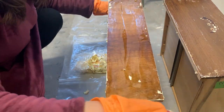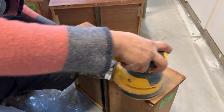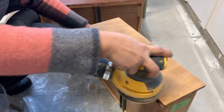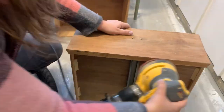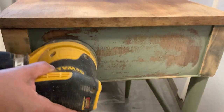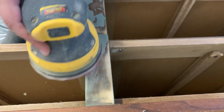After removing the previous finish, I washed these drawers with some mineral spirits, and this is how they look after. It was actually coming off really easily, so I pretty much found myself stripping this entire dresser. The body was sanded down while the drawers and top were stripped using the chemical stripper.